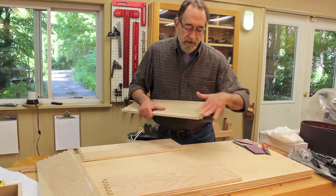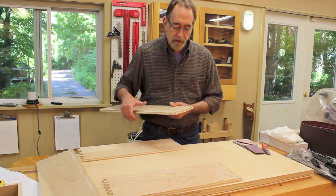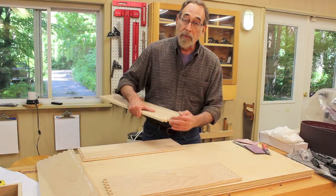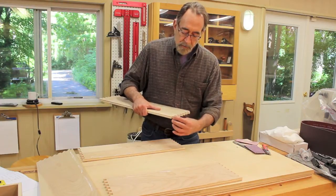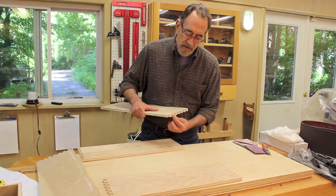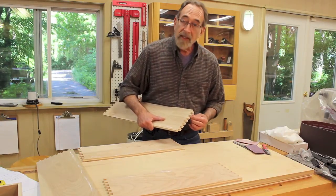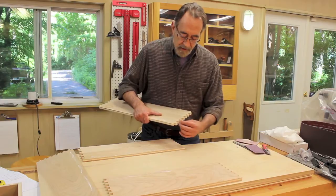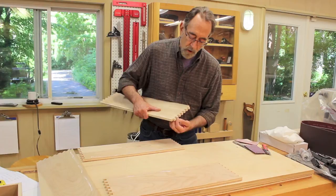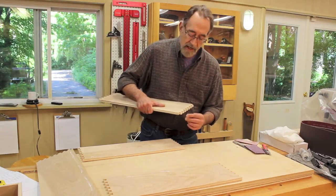The joinery is a little messy, but I believe that is the nature of the plywood. A couple of different things have happened. As the material went past the bit, it was pretty violent apparently inside there. Some of the cores inside these tongues came loose, and in a couple of instances that loose piece of core shifted to the side as the bit went past.